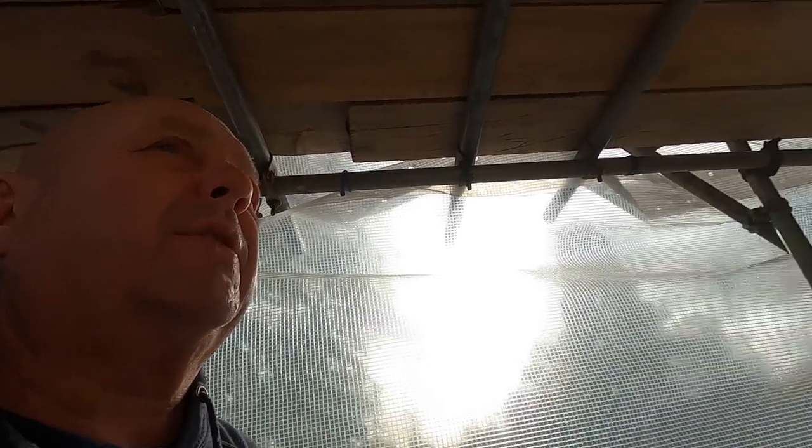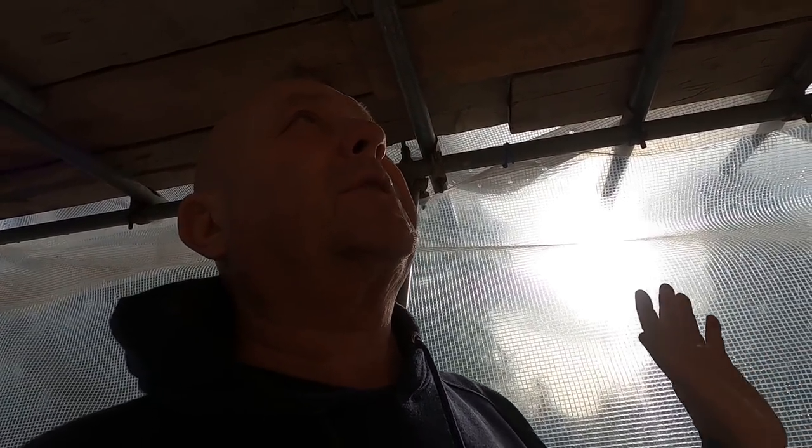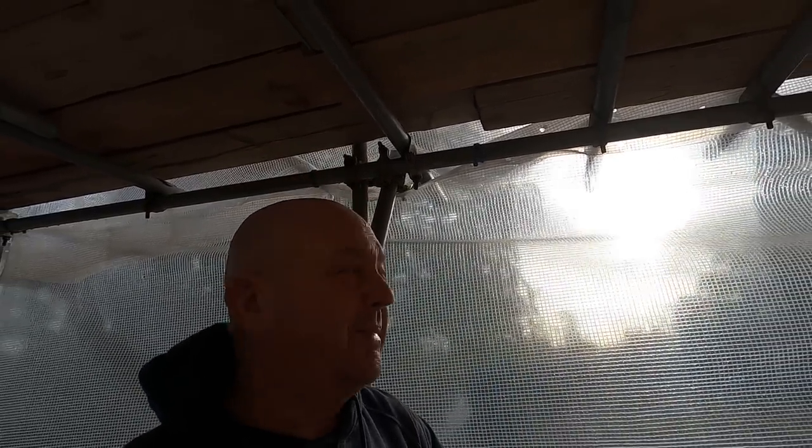And it's so important when you're putting the roof up to get that bit right. That's why you get these problems on site with these trusses and the fascias and that. They put these fascias and soffits, as I said before, up the ladder, and it don't fit the brickwork. And there's nothing wrong with the ladder. The ladder's the right measurement. It's because the trusses have not been put in plumb, which is bad really, because there's enough members and bits and pieces on the truss to even put a 4 foot level up on it, but a 6 foot level up, you should get it right really, but they don't, and that's the problem. It's a bit more difficult with rafters this long, but yeah, there is a way of doing it, and it should be right.